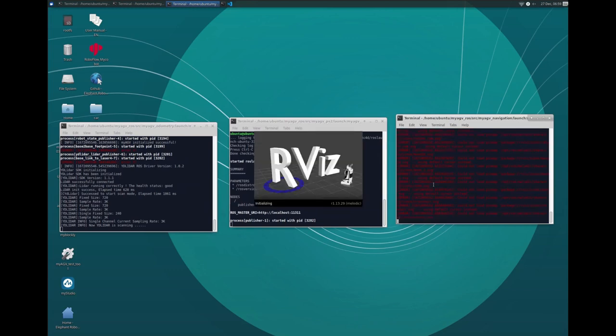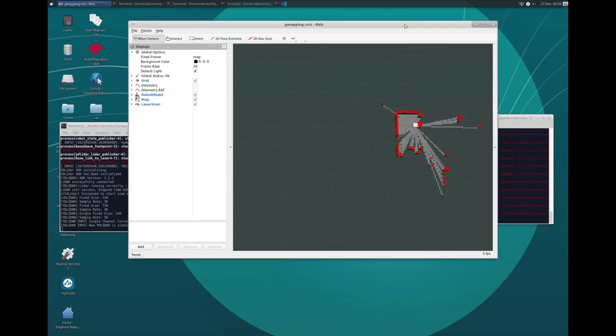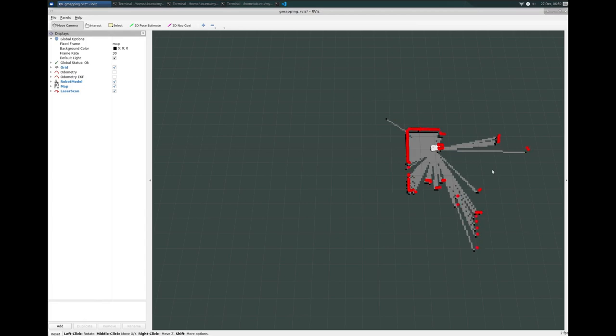Let's test out the navigation stack. For this first test we're going to show the ability to map using the G-mapping protocol. G-mapping is Google's algorithm for real-time localization and mapping. The pros: it's faster and able to run on lower-end hardware, and it uses odometry — wheel motion counts. I'm going to move forwards and turn right to try to give this the best shot, then drive down my kitchen and down a hallway and see how well the map builds.